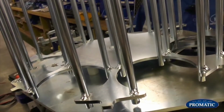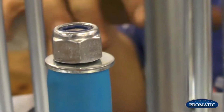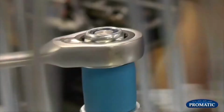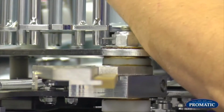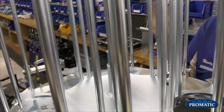When we actually come to put the carousel back on, it's important to get the right tension on the blue spacer, because what could sometimes happen if the carousel is too loose, when it gets low, it'll start double feeding, because it'll just keep spinning round. So as the rear pusher pushes it, it'll push it too much. So when we put our spanner back on, wind it back up, just to compress the spacer ever so slightly. And what we're looking to do is, when the actual carousel spins, we're looking for it to spin, stop, spin, stop. You don't want it continuously going round.